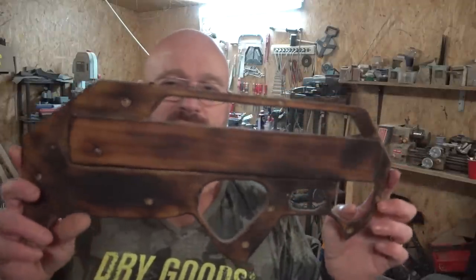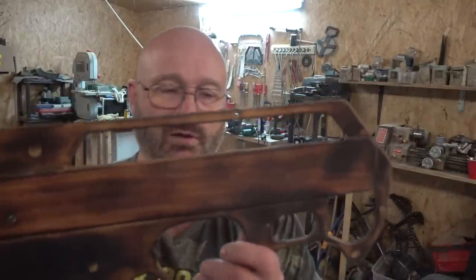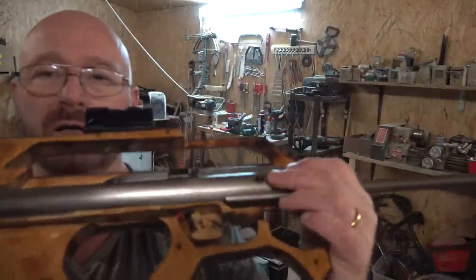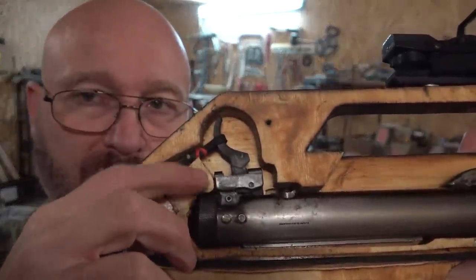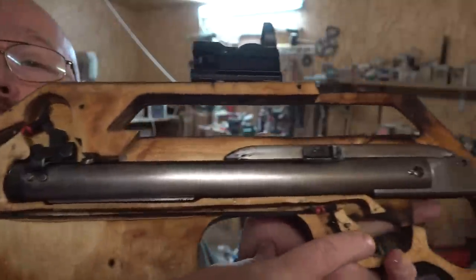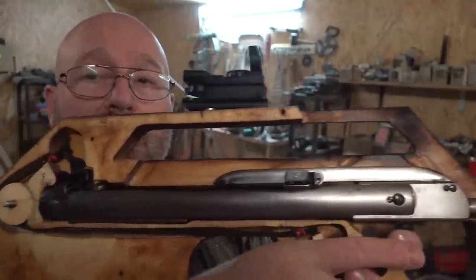This is actually the shape of the stock we're going to have. The entire system with the spring is housed, the barrel will poke up to the front, there's room for the cocking lever, and there's a space where you load the pellet into the barrel. On the inside of the left side of the stock, since it's illegal in Germany to tamper with the trigger of an air gun without a gunsmith license, I simply attached a bit of string to the trigger — the string goes over a roller all the way up to the new trigger here. This trigger pulls on the old trigger. Very simple, yet totally effective.